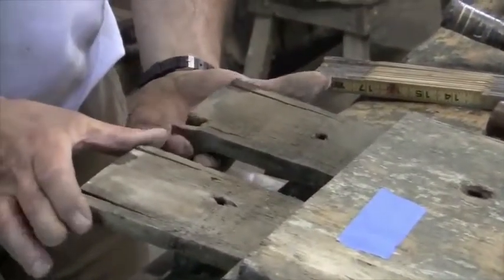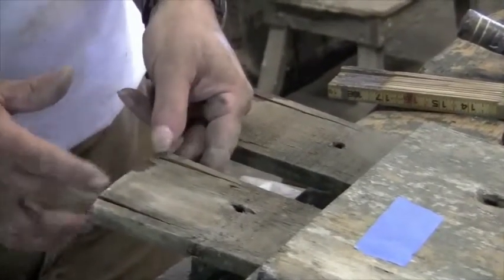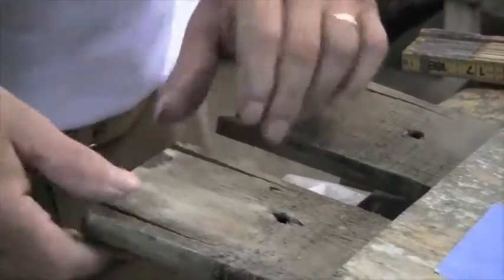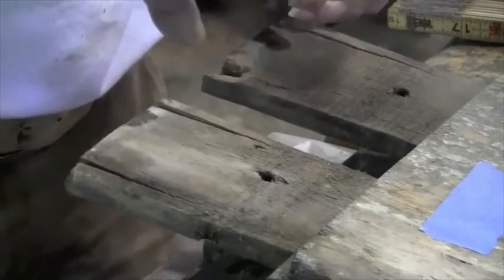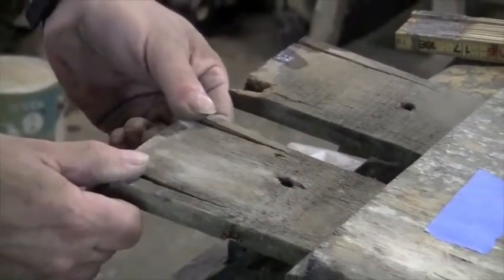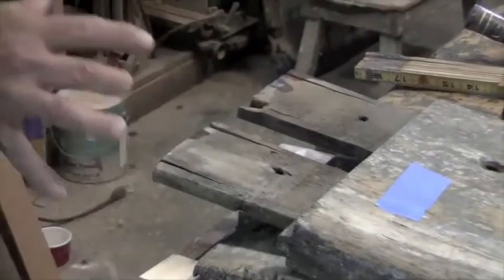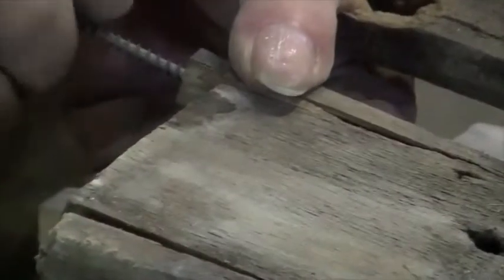They slid the tenons into the mortises when they originally made the door, and then drove a chisel in and split the tenons slightly, and then drove wedges from the outside into those splits and expanded the tenons on the outside edge, making kind of that dovetail sort of effect, so that even with the pegs and all of the tension of the fitting, these wedging out and spreading on the outside edge meant that that tenon could never draw out. To take the door apart, I had to find the ends of those wedges. Sometimes a matter of reading the grain, but I'd drive the screw into it and then yank on it with a pry bar, and out it comes.